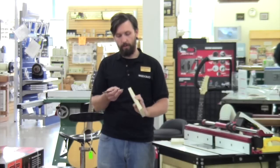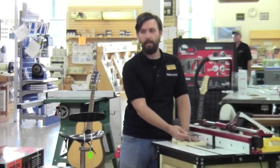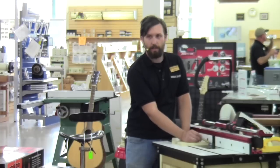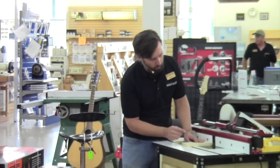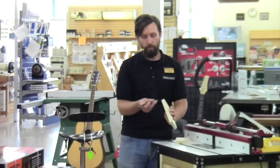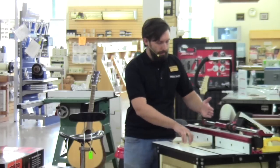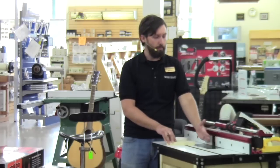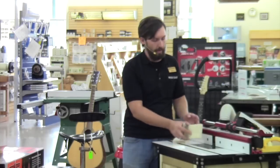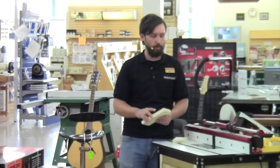What you need to do is find a center line on the stock, and there is a center line on this bit — you can't really see it. Where this upper carbide tooth is, there is a piece behind it that I kind of use as my beginning center line, and I align that with the mark I've made on the wood. I just found what was close to center. As for the fence, I've just brought it out so that about half the bit — or a little less than half — is poking out.